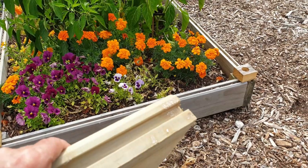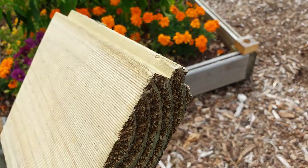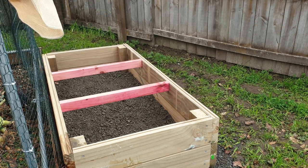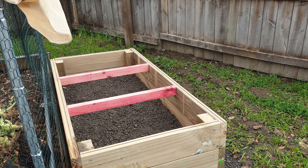These planks have a groove on one edge and a tongue on the other, so they slot together neatly, but that's not really an essential part of the design. We made the foundation box two planks high, that's 360 millimeters, just over a foot, because this part of our yard is a bit low-lying, and we needed to keep the floor of the chicken house dry. It's all held together with a length of 100 by 100 fence post in each corner, which is buried about a foot into the ground. We put two bearers across the middle of the foundation box to provide bracing for the floor.